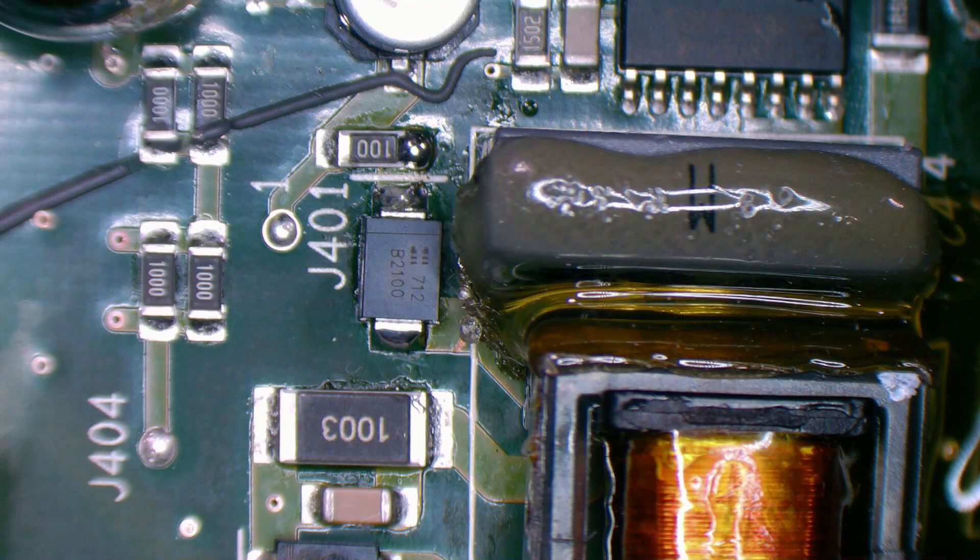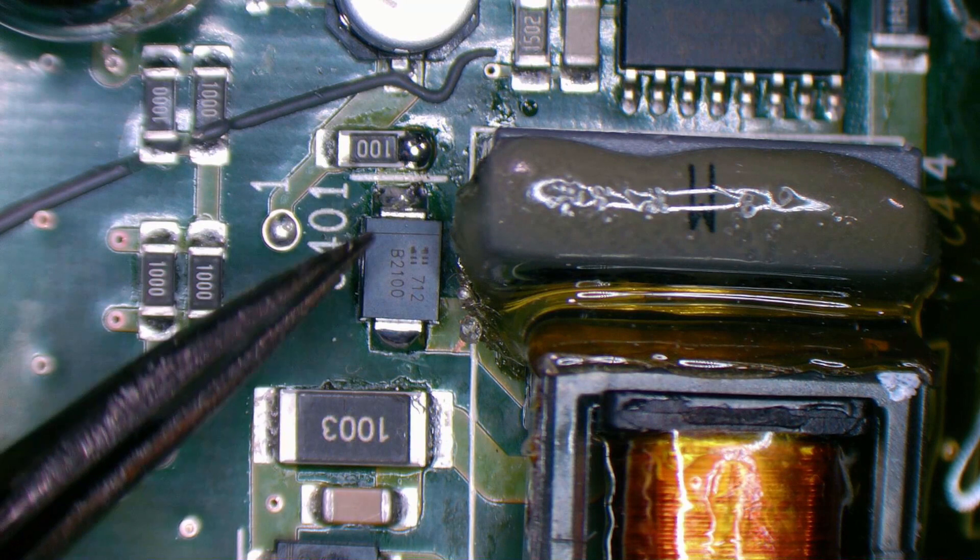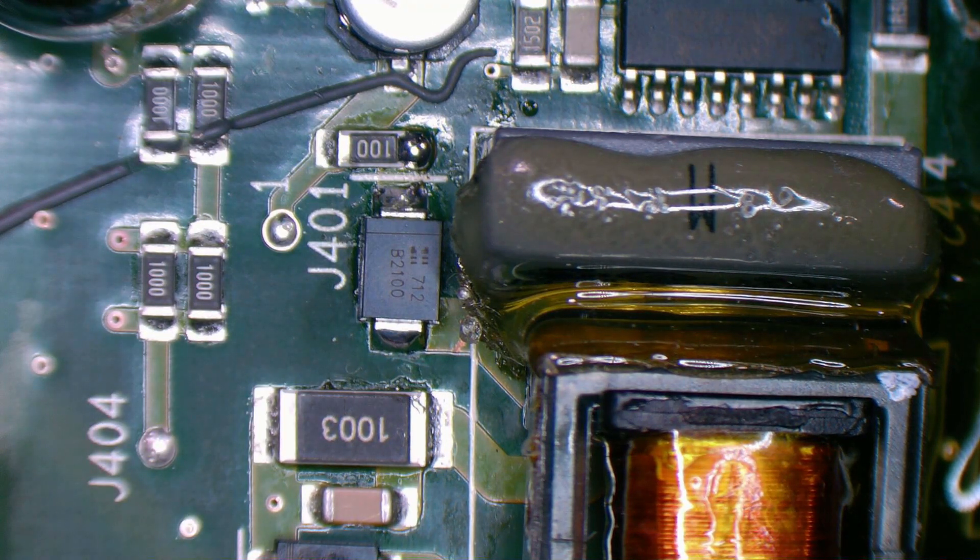In my troubleshooting I did stick a legged diode on there just to prove a point, but it actually didn't work. It turns out I was probably using a bad diode — it tested okay, but this is a Schottky diode rated at 2 amps. The manufacturer's part number is UCB2100; what I ordered was B2100-13-F, which is the same thing — a 2 amp capable Schottky diode — and that's all it was.